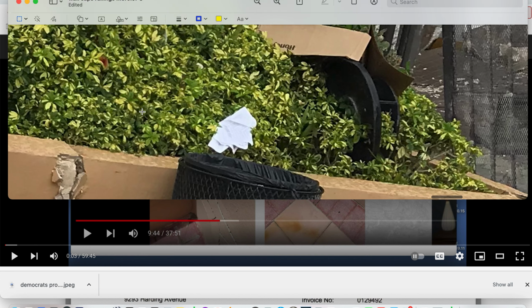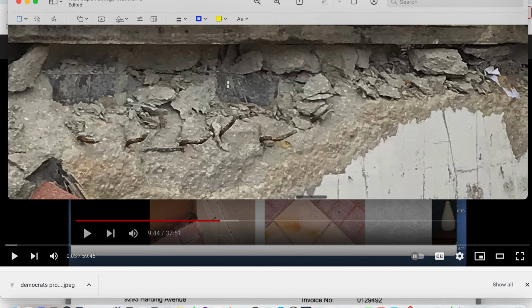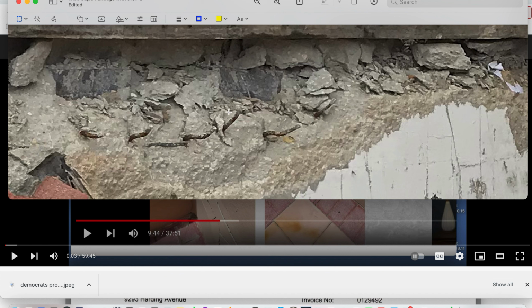The problem is people are getting too sucked into this back wall. This is where the narrative is going. This wall here. But if you look at the reinforcement, which a lot of people believe is not present, it clearly is bent over. To bend this over, there was some engagement in this floor. It was being held by this rebar, this vertical up and down. And it held to some degree before it also broke free.